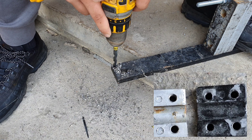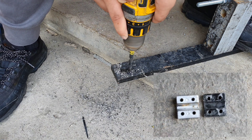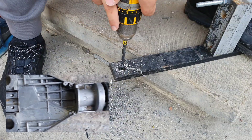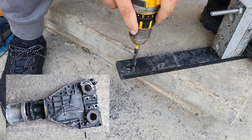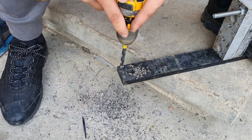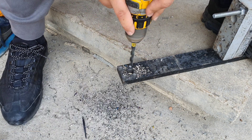The alloy brackets that secure these motors were sourced from the original hoverboard frame. While we couldn't weld them directly to the steel, we can use bolts and locking nuts to hold them in place through these holes. Because we are going to be using bolts and locking nuts, we do not need to thread these holes.